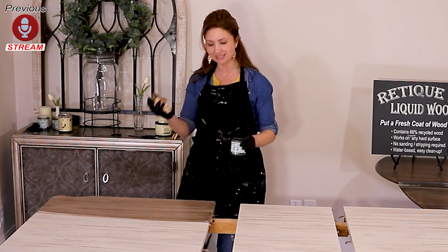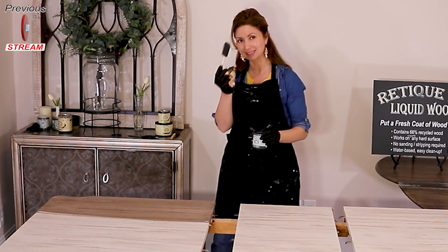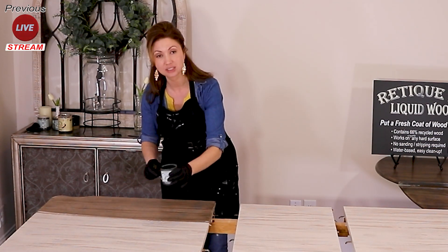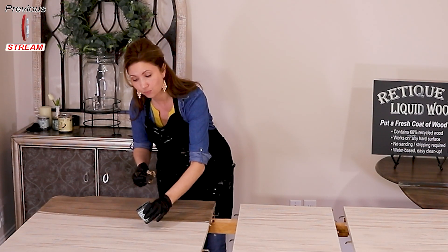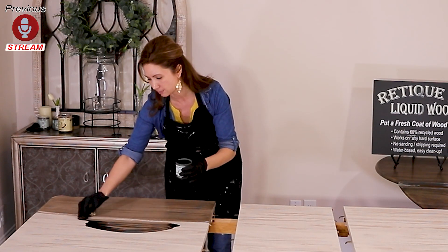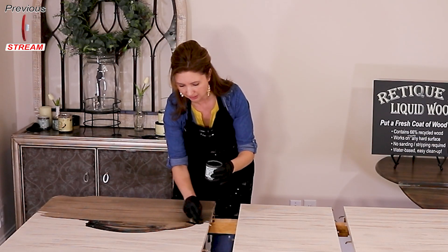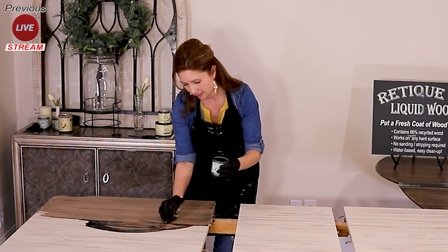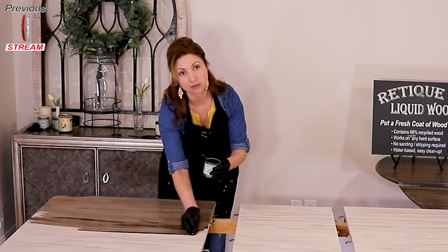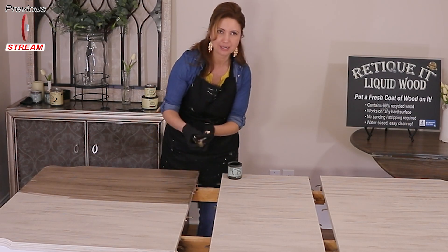Since this is such a big table, you might want to think about doing it a little differently than just using a little sponge brush. So I'm trying a different technique — just pouring it on. Our water-based gel stain is not thick, and the reason for that is so that we can actually put it in a sprayer. So if you're a professional or somebody who just wants to get a lot of projects done, you can put this in a sprayer and get that really high-end professional look. It's really great with mahoganies and dark cherry where you need that really contemporary, non-streaky stain. And for me, just pouring it on is really more efficient.